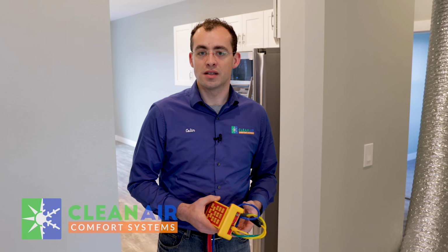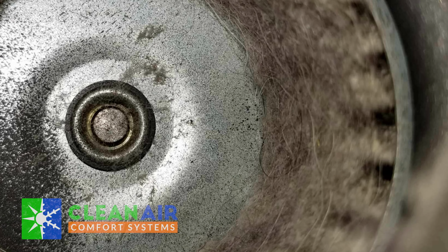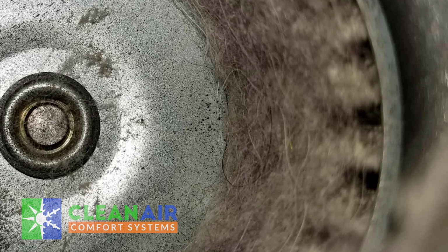Some of the other things to consider are air quality in your home. If your ductwork leaks, it doesn't just lose heat to your crawl space or the attic, but it also pulls in cold air from those spaces, and most of the air in the crawl space or the attic is full of contaminants: dust, hopefully no rodent particles, but that's possible, insulation, construction debris and dust, and all of these are irritants to most people. So having an airtight ductwork system will not only save you money, but make the air in your home a lot healthier to breathe.